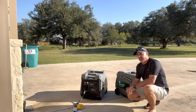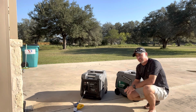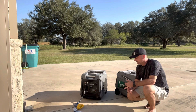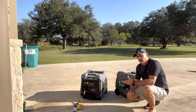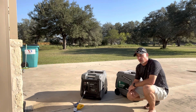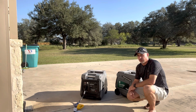Thanks for tuning in. Today we've got two of the Cummins P4500 gen sets. I have a parallel kit and the standard gen sets. What we want to do is see if one of these units can run two 15,000 BTU air conditioners. My camper has two of those. I also have RV soft starts installed on my AC units, so there's no inrush amperage.